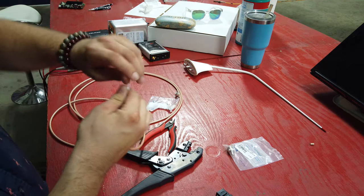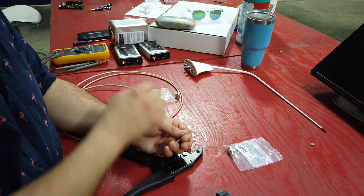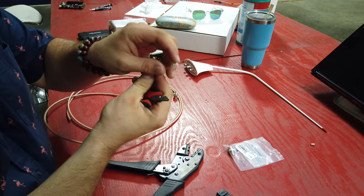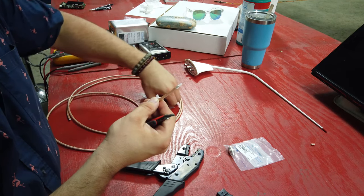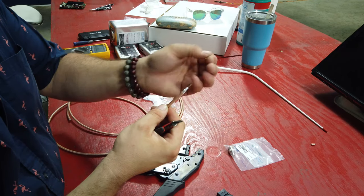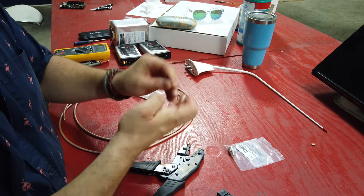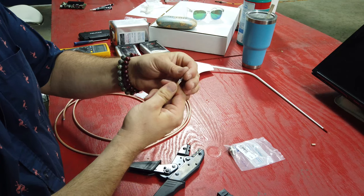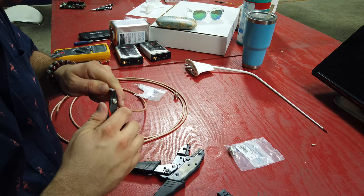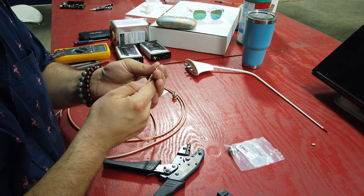It comes off with the grounding wire just like that. Now, these center wires are the most important — you need to make sure no wires end up on the outside of our brass fitting, because that will cause a grounding issue. I'm going to take this tang and push it down into it. You can see it doesn't lay flat with our nylon yet, so I've got to trim this wire until that happens. I'll cut it there and put on our copper piece. I'm a perfectionist so I'll trim that next little bit off too, and make sure there are absolutely no stray wires sticking out — if you get a ground you're going to kill your avionics.